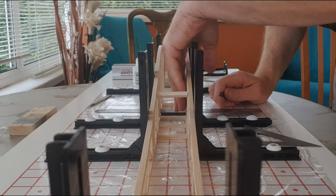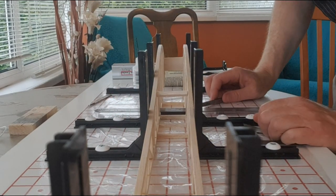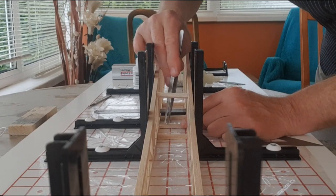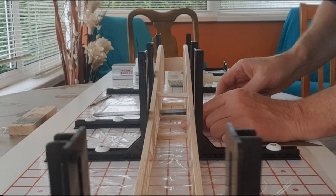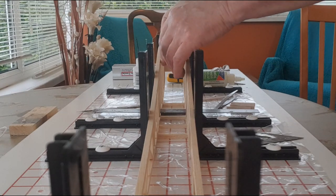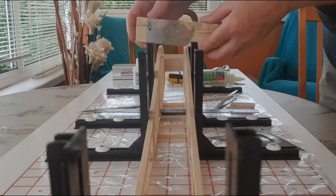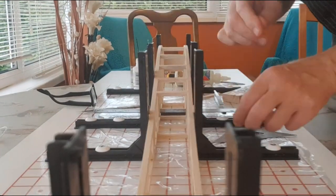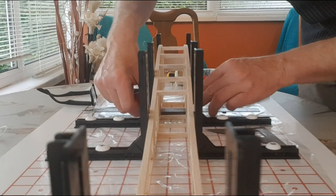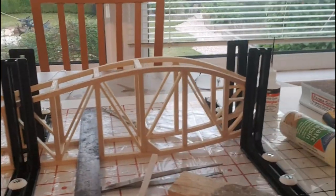I've got a piece of plastic down underneath to protect the building board. Nice and flush to the bottom. Now I'm checking everything square. That's looking pretty smart, I think — quite happy with that. So we'll let that set off and then I can start trying to bend the front and back in a little bit, then decide what form of sizes I'm going to cut because I'm making it up as I go along.